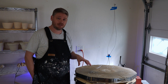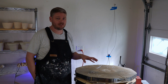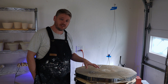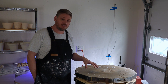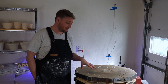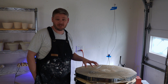That is not too surprising — this kiln is extremely old. I was hoping I could get by with the elements in place but it seems like that's not the case, even firing to cone 6. Also, if you remember from my previous videos, the bottom ring in the kiln is actually the old middle section and the bottom element is technically undersized — I was hoping I could get by with that too, but again that seems not to be the case. So I ordered a brand new set of elements for a 10-18 kiln, which now matches this configuration. When those come in I'll replace all the elements, and I think that may actually be the last thing to get this thing to fire. Once the new elements are in I shouldn't have any hot zones, and with brand new elements that should not be a problem. At that point the only thing left of the original kiln will be the fire bricks — all the electronics have been replaced and the elements will be replaced as well, so I should have basically a brand new kiln.